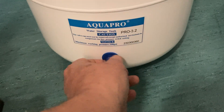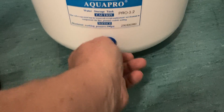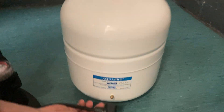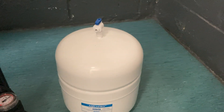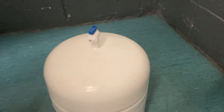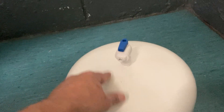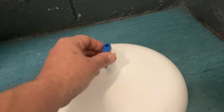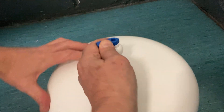This is what's called the Schrader valve — you just untie this and attach the pump to it like that, and that would just force out any of the remaining water. Then what you do is turn off the tank using this valve at the top, where a tube comes into it — just turn it like that.